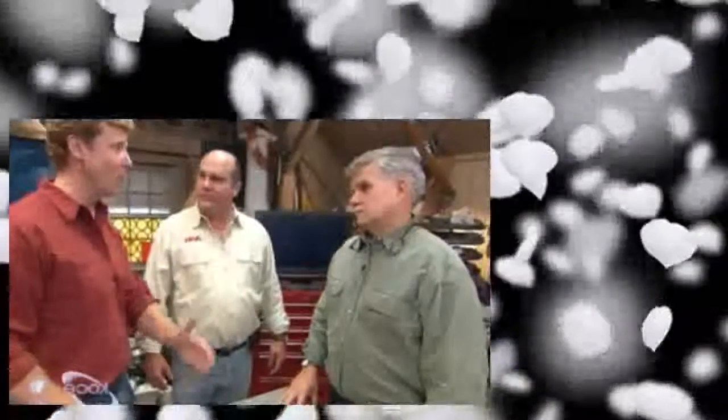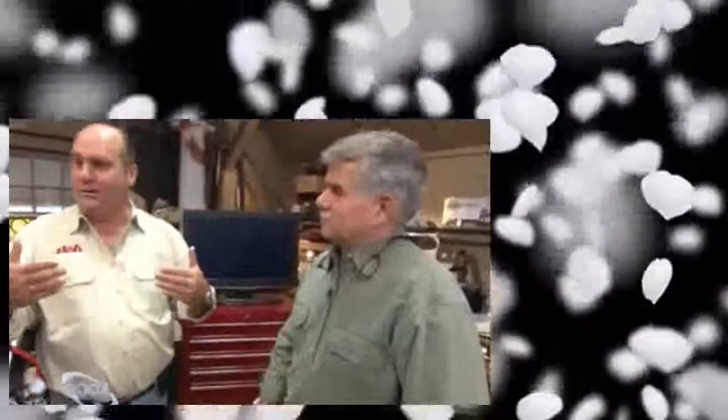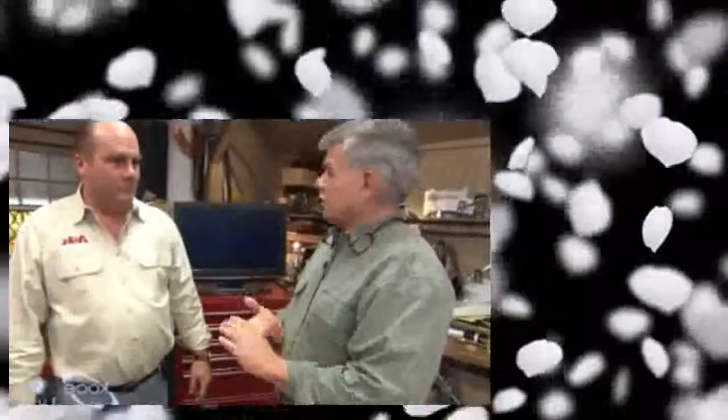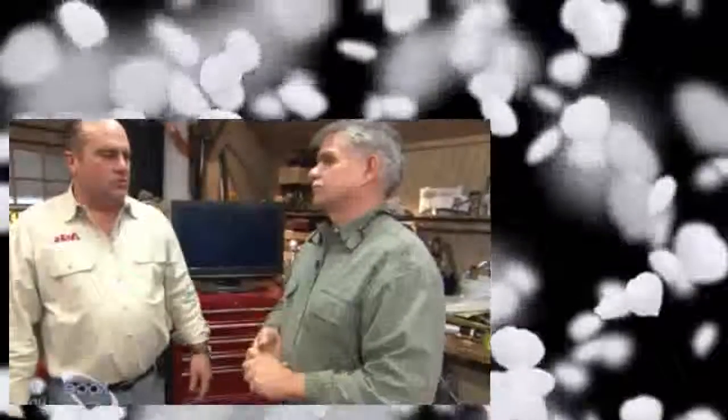Tommy, it was great that you were able to go up into the attic, pull the floorboards back, look at that anatomy of that wall, and confirm that it was load-bearing. Right, it's always good when you can see the bones of the building. But you can't always gain access from the top. And even if you are 99% sure that wall can come out, it's still nerve-wracking to cut a wall. Well, even if you're a little bit unsure, you should always bring in a professional to tell you if it's a load-bearing wall, what size header you need for that wall, and how to temporarily brace it so you can cut that opening. It's really short money. I think I'll call you.